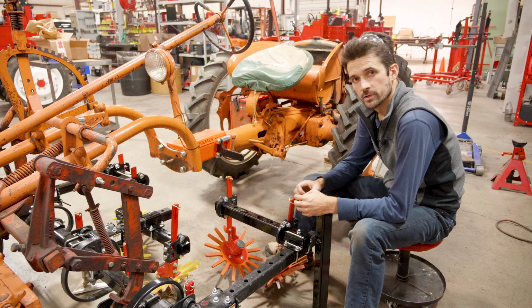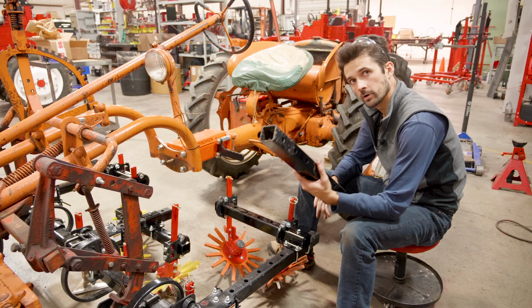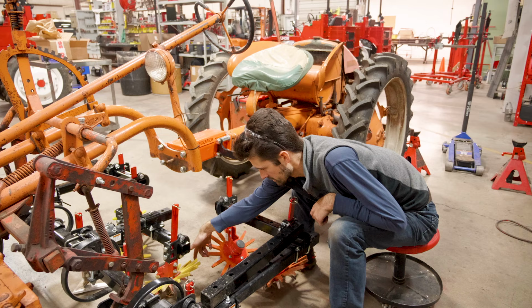So apart from adding the extension in the middle, there's only one change that really needed to be done for the 13s to fit really comfortably in the setup. Before, it had a mod bar that was this length, so that would have been about right to this position. This clamp would have been in here, so we would have moved the bar up to about this position. The issue with it was, well, there's two issues, but one, the fingers were touching, so that was a no-no.